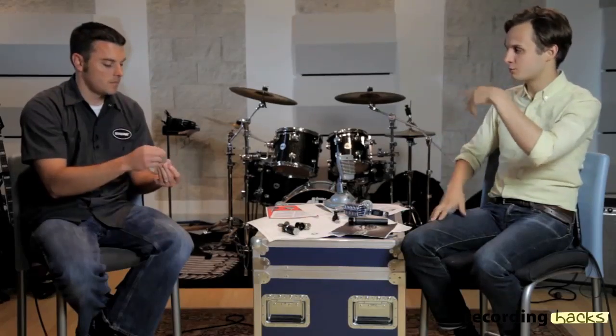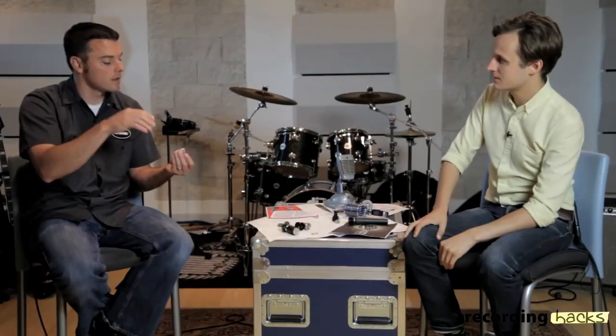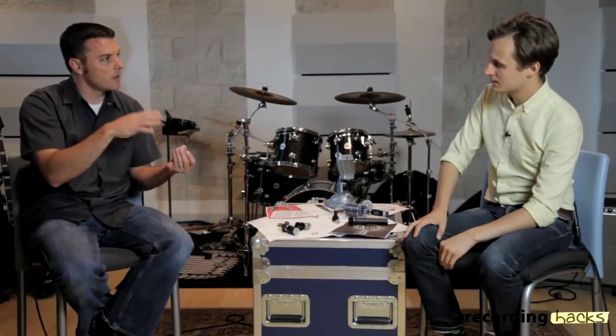Let's break down a couple of those things. So we're a sound wave — an acoustical, mechanical phenomenon. The first thing we hit, besides a resonator cap which we'll get into later, is the diaphragm. At this point we're still mechanical vibration. We're moving the mylar — the very thin diaphragm — which is attached to the coil of wire. This is where we're transducing: turning one form of energy, acoustical, into another. That acoustical energy is actually minusculely moving the diaphragm — we wouldn't be able to see it, but it does move. And because that coil is attached to that diaphragm, it's going to move that coil of wire also.